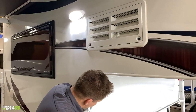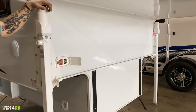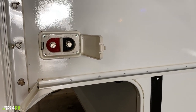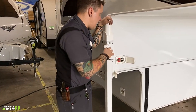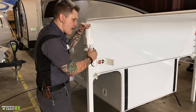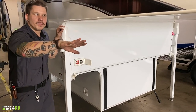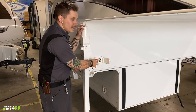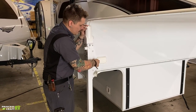Last thing on the outside is your secondary battery terminals. On the inside, the battery is a Group 24 deep-cycle battery in a sealed battery box, so it's not easily accessible. Lance provided secondary battery terminals to allow you to do any battery tending, check voltage, or even hook up a solar panel. Think of these as your accessible battery terminals — they'll make things a lot easier.